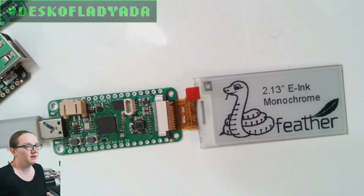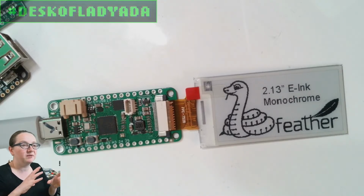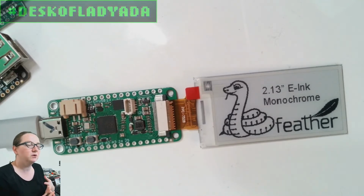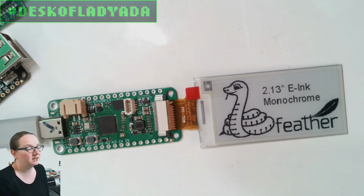And these are chips that are basically USB to hardware conversion. And you have a special driver from FTDI. I don't have an FTDI board here, but basically you have USB commands in, and there's a couple GPIO, and you can do I2C and SPI and UART. But the problem is that these chips are fixed, right? They can only have certain functionality.